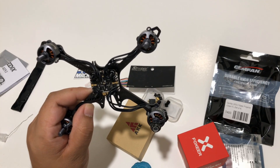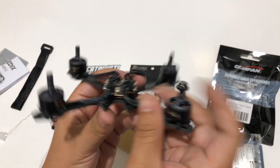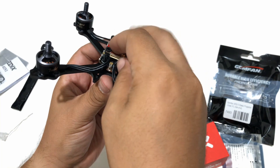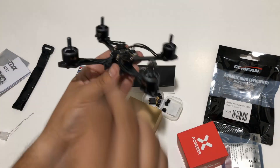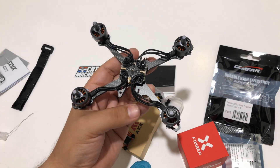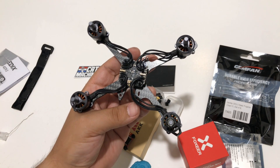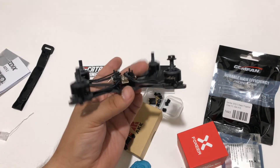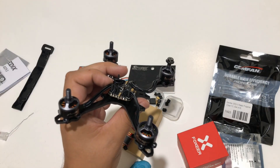So I'm probably going to run a standoff on top with a small screw and screw the top piece on. Let's go ahead and start soldering up the motors. Now I have the motor wires soldered up but I notice a problem — I normally like to run my wires on top of the ESC on full-size builds, but since this is a micro, if I slide the flight controller on with the gummies it doesn't sit down. The Speedix has pads on both sides, so I could re-solder everything on the bottom, or I can just flip the whole thing and leave the connector on top.